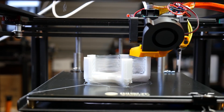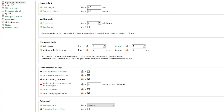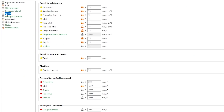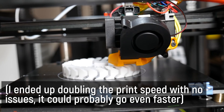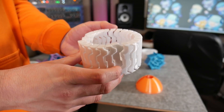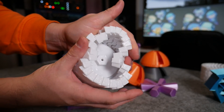My previous flexible prints were stringing central, so some of you suggested this awesome PrusaSlicer NinjaFlex profile — which is freaking awesome in Polymaker's TPU95 high flow. I simply modified it to suit the D01, and each wheel is printed on its own. Straight off the printer they look fantastic; even the overhangs printed decently and the wheels have this interesting flexibility to them.